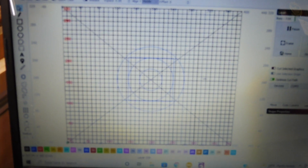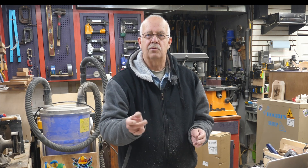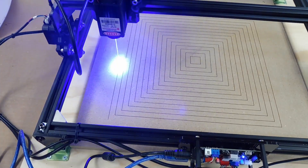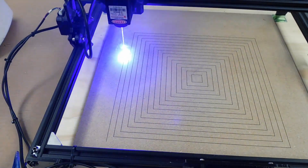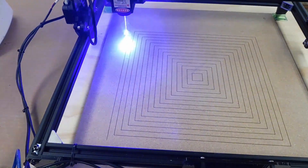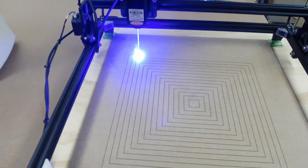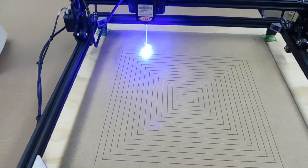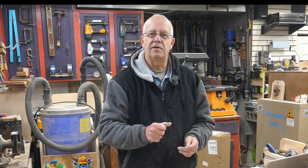But we had some failures — it was hanging up, stalling, jumping off the lines, and I finally aborted that and went to 300 by 300, which you can see engraving here. I have this set up for coasters, tiles, and that type of thing — that's what I'm actually going to use this laser for. I've made quite a few tiles and we're going to get into what I discovered about the life of the laser head.